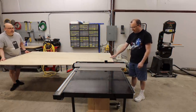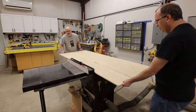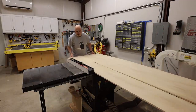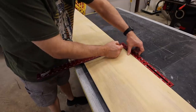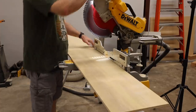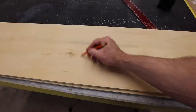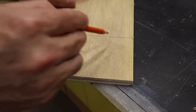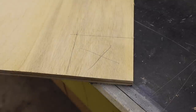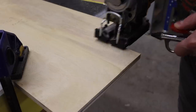With the room painted, it was time to start building the credenza. Luckily David was in the shop today and able to help me cut down the larger pieces on the table saw. I then went to work measuring all of the different components, marking them to length, and cutting them down to size on the miter saw. I like to label each board with its location, name, and orientation marks to make the assembly process easier. Some boards needed additional cuts — the toe kick, for example, needed to be removed from the end pieces, and I used the jigsaw for those operations.